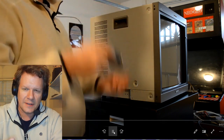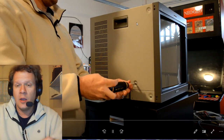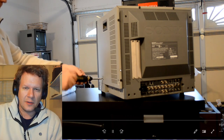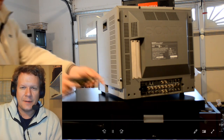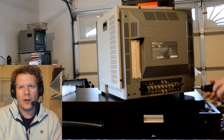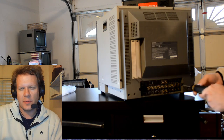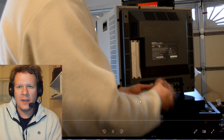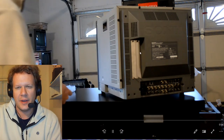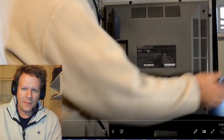When you originally look at the side of this monitor you'll notice there are some extra screws that will not be removed to get the shell off. What we're going to remove are the three screws on the larger piece of metal on each side, and then there are four screws on the back of the PVM on the plastic holding the board and other things in place. Once you get those screws out, you should be able to get behind the monitor and slip the shell off slowly, pulling it back towards you, just like any other PVM.